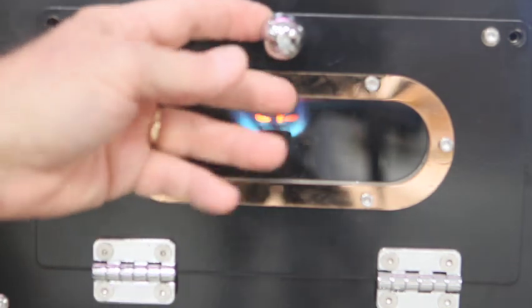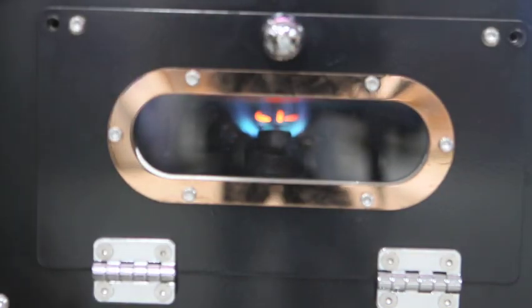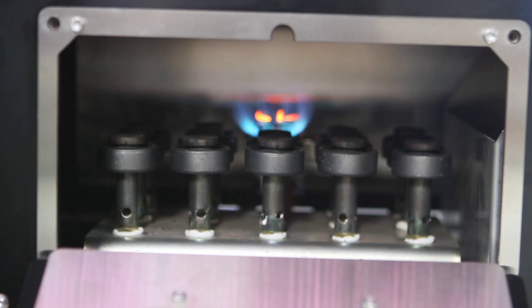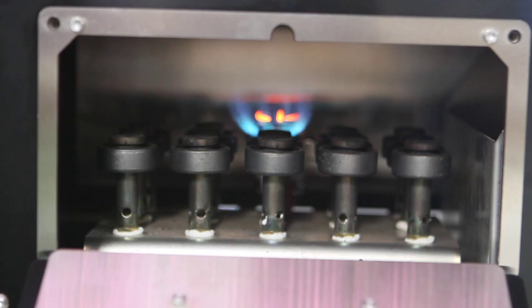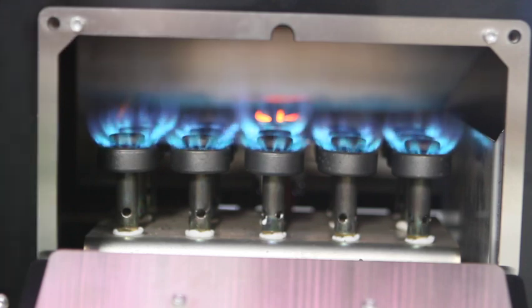For the sake of this video I'm going to open up the front burner doorway, which is closed with two thumb screws. I don't recommend you do this when roasting because it will affect air flow. You can see that single pilot burner lit. Then you can slowly turn on the front needle gas valve on the roaster to light the burners. You need adequate air flow — usually about two or three on the manual damper — and now you can see all the burners lighting up.